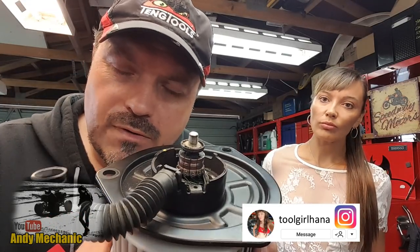So where do we start? Well, the first job is to remove the armature from the motor, and we're going to chuck it in the lathe, and hopefully there's enough material left to machine down, because I've got to clean that up. So I'll gingerly clean it up. It may not be perfect, because like I say, there's not much material left on that commutator. The groove that's been worn down by the brushes is pretty deep, to be honest, and if I overcook it on the lathe, then the whole thing is junk.